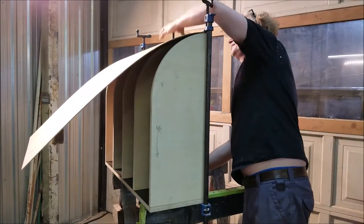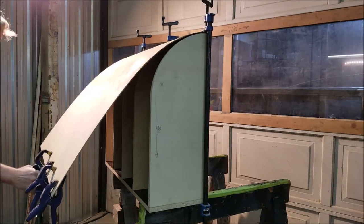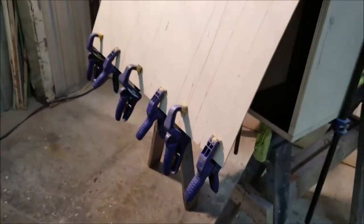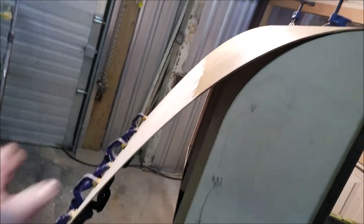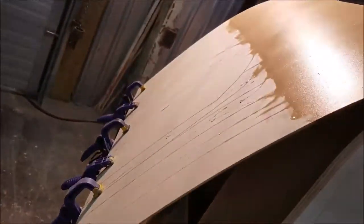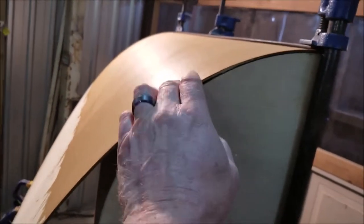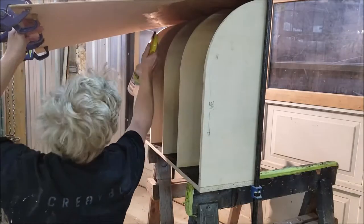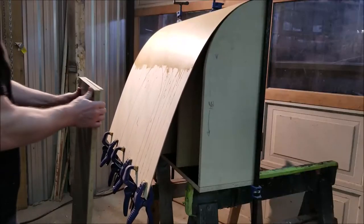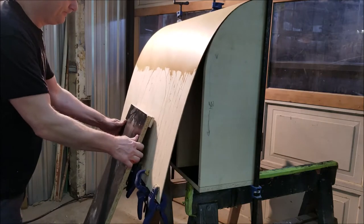This is honestly easier. I'll just set it up here and let gravity take over — it's magic. I'll quickly go over a couple of other materials you could use at the end of the video. The number of clamps you put on depends on the amount of leverage and how long and heavy the board is, so you have to kind of guesstimate — you don't want this to break. If it starts drying out you can always add more of the magic solution. I'm just adding a little extra weight here; it's starting to take the curve.